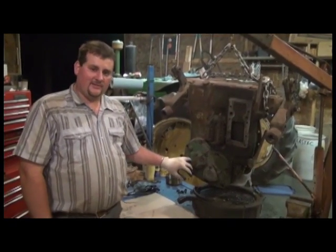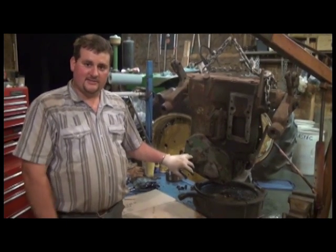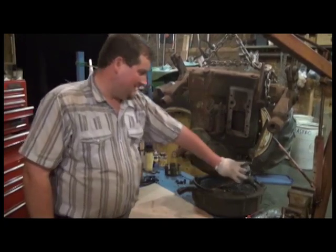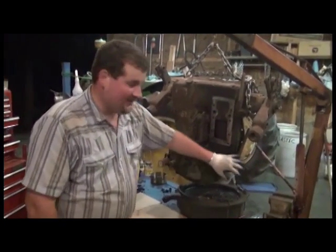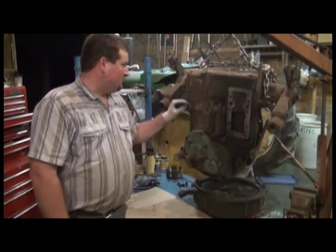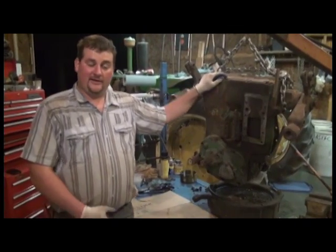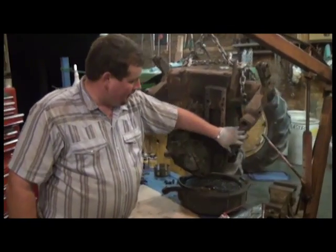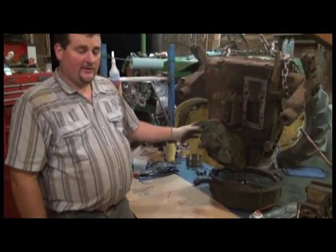If you do it on the tractor, it's important to note that if you have a 3-point hitch on your 20 or 30 series 2-cylinder tractor, you will have to remove it and the right side draft link support, also known as the elephant ear, as it interferes with clutch linkage and so on. You also have to disconnect the power shaft clutch foot linkage and remove it completely from this arm that engages and disengages the clutch.